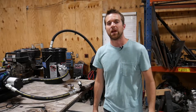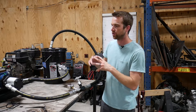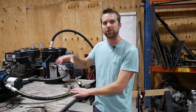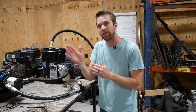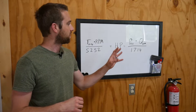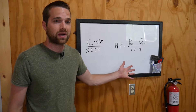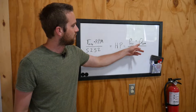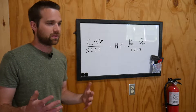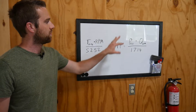I got some questions about how to spec the system and the math behind making sure the pump can handle the correct amount of horsepower given pressure and flow rate. Heading over to the whiteboard: one side covers the spec of the system and the other covers how the DAQ system works. On the right side is the hydraulic power equation — pressure, flow rate, and a conversion factor. On the left side is the more traditional torque-based mechanical power equation — torque, RPM, and another conversion factor.